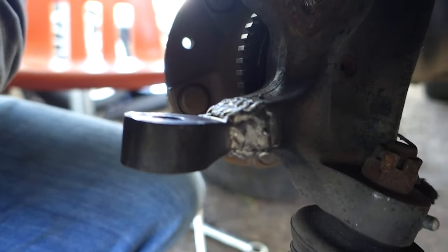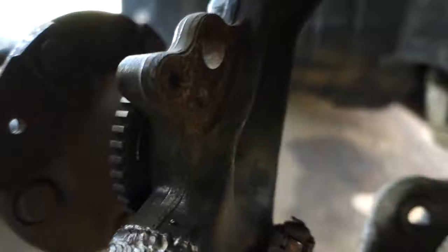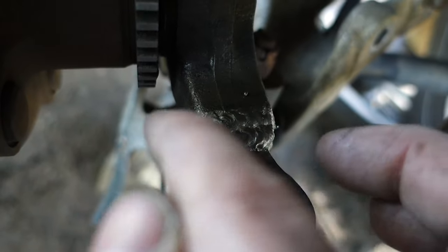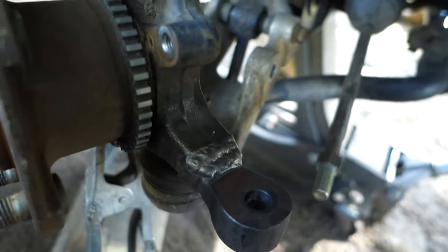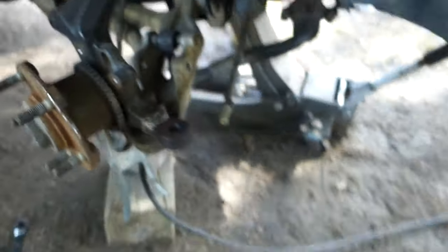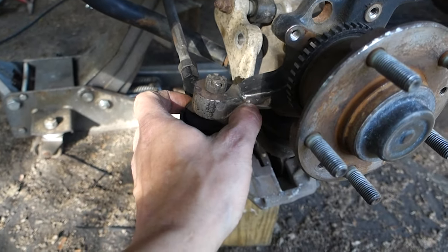It's definitely not a professional welding job. I kind of just kept going back and forth trying to get a lot of penetration and heat. On the top I went through the channel and then went on both sides of the channel to build up the material. I'm debating whether to grind it smooth or leave it, but I'll grind it smooth — it'll be easier to see if it cracks. There are a few spots on this side that don't look as good.